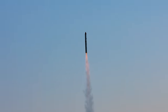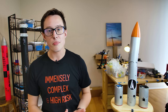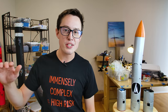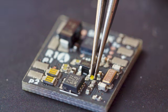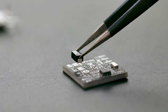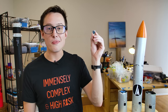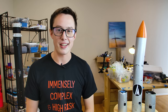We need a way to light rocket motors in the air. We're going to do that using a little digital switch called a MOSFET. We also need a way to know what the computer is doing so we can tell if it's ready to launch, and we'll do that with two LEDs — one on the front, one on the back. We'll finish this out with a few voltage regulators and a diode. The diode protects against reverse polarity — if we plug it in backwards, we don't want the magic smoke to come out, because it's really hard to put the magic smoke back in.